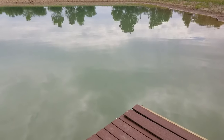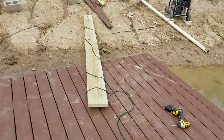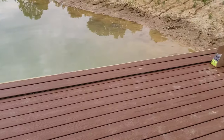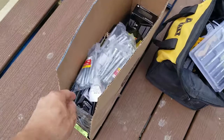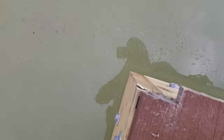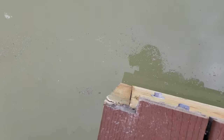Out on the dock — and this is probably the best scenery you could ask for for a job site. I'm going to set my corner post first. I cut the corners a little bit so that the notched post will sit down there. I'm going to start with these two here because if you recall from the dock video, that end's not buttoned up yet. Each one of the posts are getting two 3/8 inch lag screws — the corners are going to get four, two on each side — with washers. When you put in these bolts, make sure you pre-drill them because the lag bolt for this post is going to go right in the end of this 2x12. Pre-drill so it doesn't split.